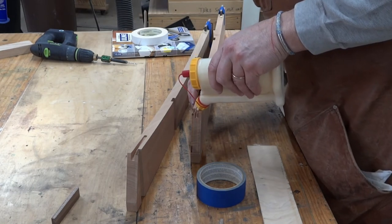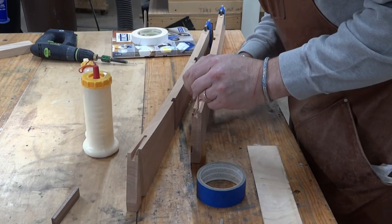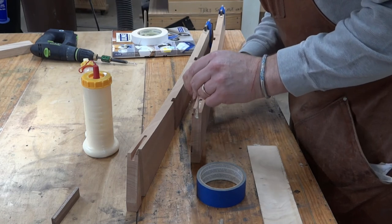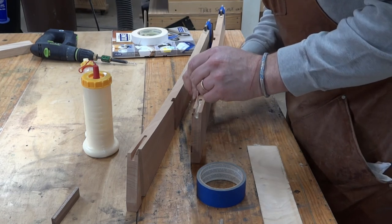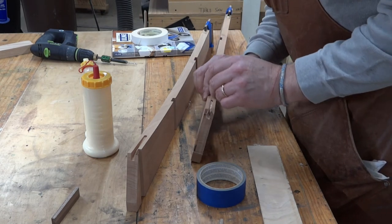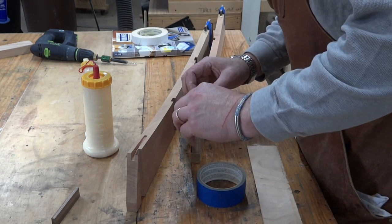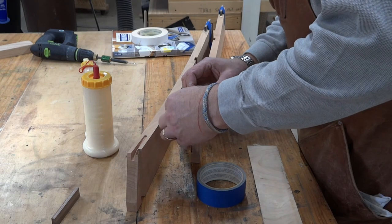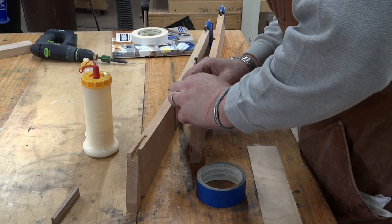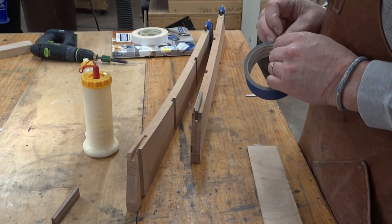This is putting in the walnut inlays, and I didn't record this at all, but when the board was still square, I just routed a quarter inch groove 3 inches down, and I knew about how far in that arc was going to go, and I just made the router bit about a quarter inch deeper, and then just cut some walnut to fit in there and routed the edge so it fits the edge of that, which is the quarter inch diameter bit, and it fits in there real nice. Just use tape for clamps.